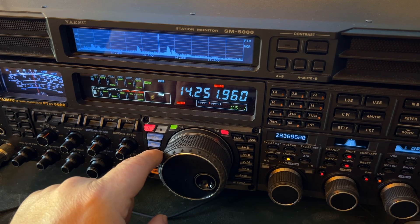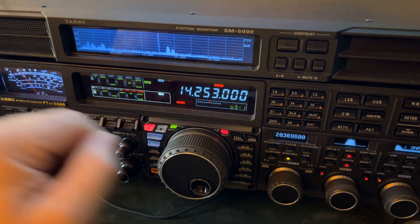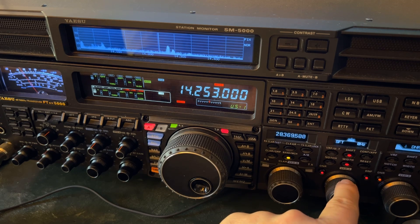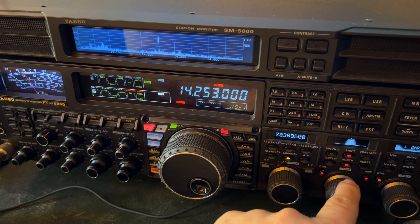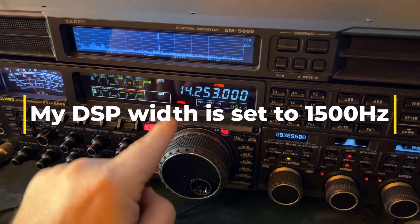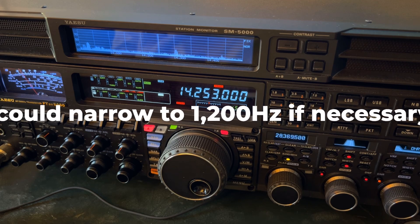Well, there's somebody 3K down. The one at 14255, because this is upper sideband, will present a high pitch metallic sound when they're bleeding over — they're two kilohertz away, maybe even two and a half or three if they've got a dirty transmitter. But when you go negative with the shift, and there's somebody on upper sideband below this frequency — the other one was at 14252 — you're going to pull in more of that lower honking sound from them. So what do you do when you're sandwiched between the two like that?